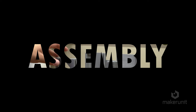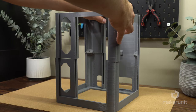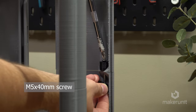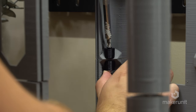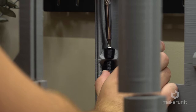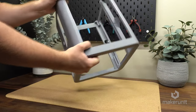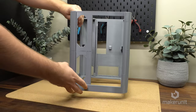Now let's look at how to build this thing. The main chassis consists of two main parts that mount together to form the frame that all the parts later will attach to. These are clamped together using printed 45 degree washers and an M5 by 40mm machine screw and a nut. I made these at an angle to make printing easier and to eliminate the need for support. But why make it simple when you can make it complicated, right? Once all corners are attached, the frame feels really rigid and we're ready to install the bottom part of the case.